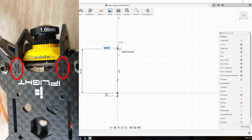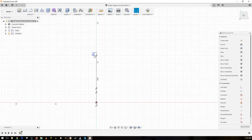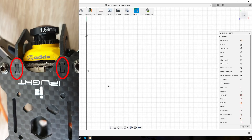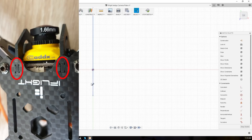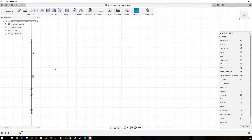Here's another two millimeters. This might not be the best way to go about doing it, but this is the way I usually do it and it works just fine. So we're going to go ahead and just do two millimeters. This line here is going to be part of the tab that will go into the upper frame to hold the camera plate in position, and the bottom here as well — that should be two millimeters too.